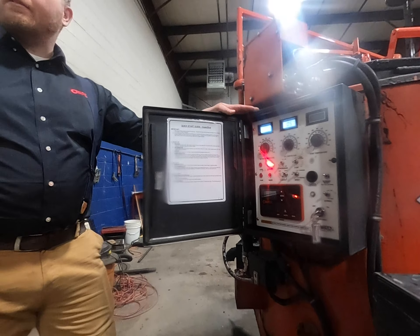If something gets stuck, just come over to the mixer switch, go reverse for a second, then back to forward — that usually frees it up. Worst case, just wait a little longer to melt it. You can leave the mixer in forward and start the machine and it'll do everything automatically. Other switches are super simple: compressor for when you need it, lights for work lights or the strobe, mixer switch stays in forward normally, and pump reverse — we'll cover that at shutdown. Just wait for everything to get up to temp, and when the pump light comes on you're able to start putting material down.